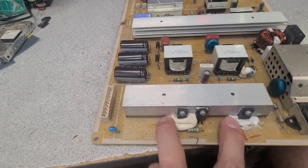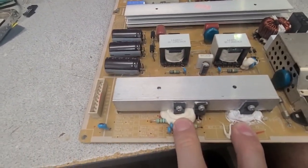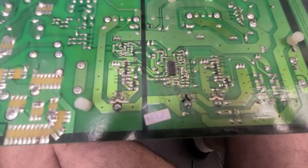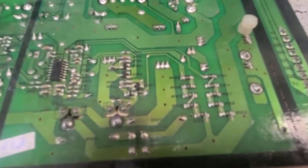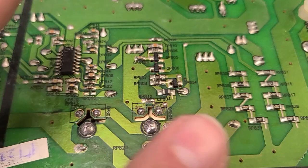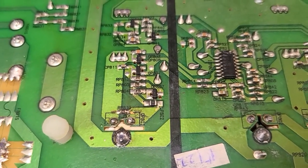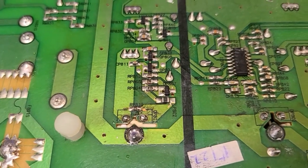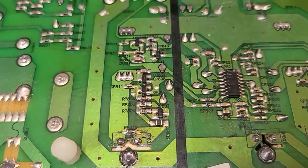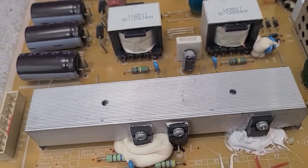As a second rule, whenever that pair has failed, this component needs to be replaced as well — I don't want customers coming back after a week. We always replace both pairs with new ones. While we're at it, we also clean the copper contacts and the back so those solder joints don't start cracking. The manufacturing here is poor — Samsung could have exposed more of the underlying copper for better contact but chose not to, likely for automation reasons. Whoever did this repair didn't clean and solder properly on the back.